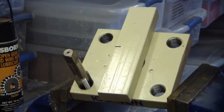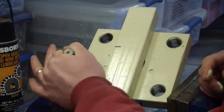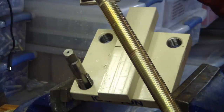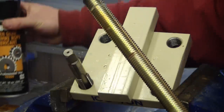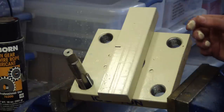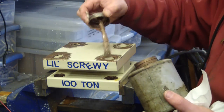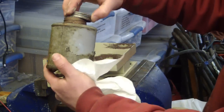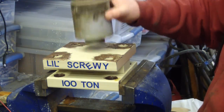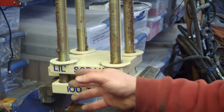Getting excited — we're getting close. You can see the magnets in there, paint's still a little wet but no big deal. I'm chasing the crud out of the threads with the one-inch bottoming tap, which is the only tap I had, but I still managed to thread the holes. Now we're going to lubricate the threaded rod. I'd love to use open-gear grease — high-pressure black Moly — but since the white couch debacle of '03 it's contraband in the house. So we're using copper Never-Seez. The brush never reaches the bottom — that's because they want you to buy more of the stuff, the dirty bastards. I found the workaround. All four rods threaded in.